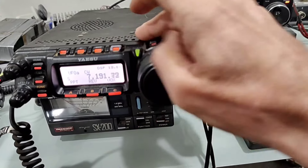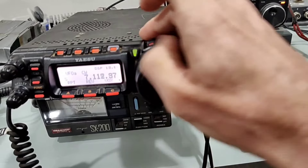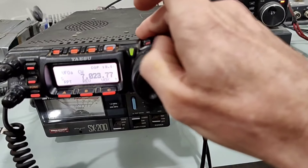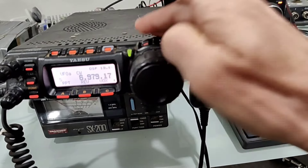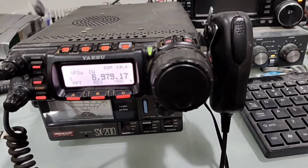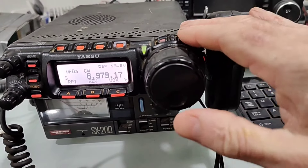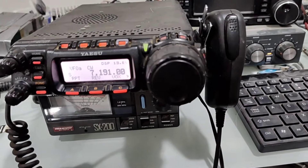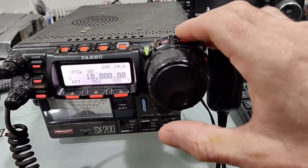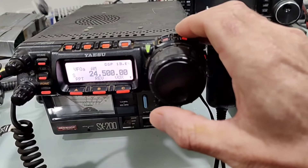I'll fly out of band, I'll go down. It would transmit, of course, in the 7 megahertz 40 meter band. If we go below it, it would not transmit normally. You can see it now transmits, and of course it transmits in band. So that's all good, and this happens through all of these HF bands.